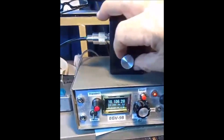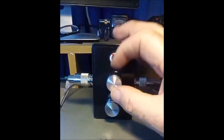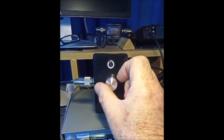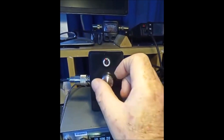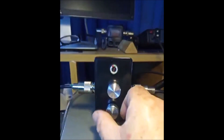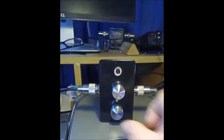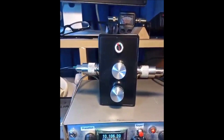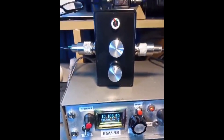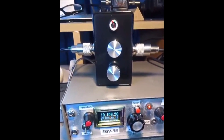There's a carrier — so position 1 — and I'll try to get the meter to full scale deflection. Okay, that's about it there. Now I go to position 2 which shows me the relative SWR. It's not too bad but it's not zero. So that's with the 40 meter dipole connected directly.